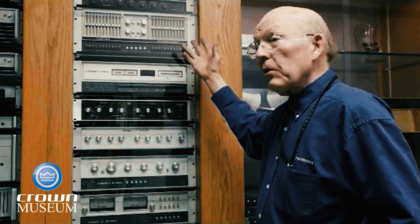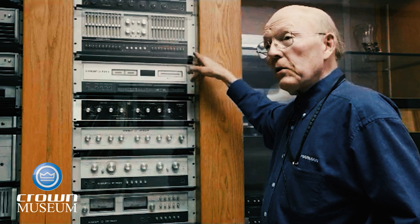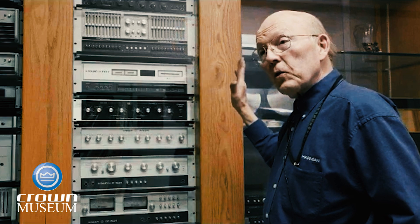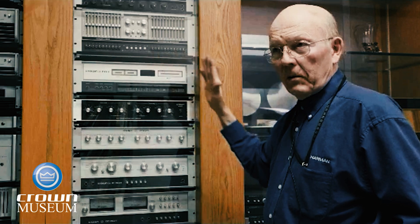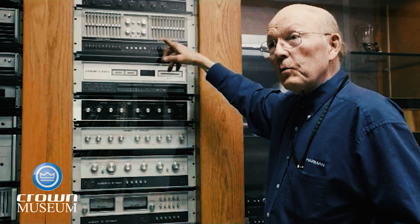So we opted to go there, and thus what it is. The circuitry used in there is a circuit that when you change a simple rheostat to ground, the filter moves at constant bandwidth. The bandwidth is invariant to that, but the center frequency tunes. That's a quirk of that particular topology, and it's used in there with purpose.